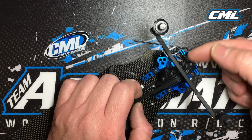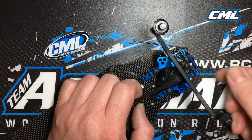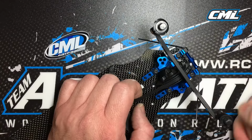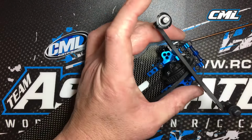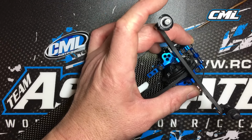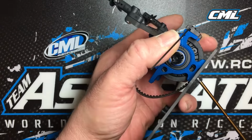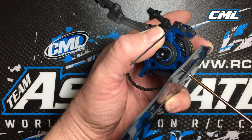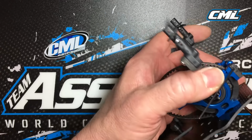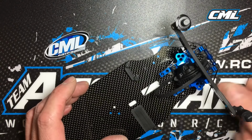And you might think that, oh, that needs filing down a bit because there needs a bit of play, but the chances are it's just your bulkheads are not aligned properly. So what we're going to do first of all is just loosen everything off. So I'm going to loosen the plastic mounts off there, and I'm going to loosen off the bottom screws of the bulkhead. There we go. Right, so that's all now nice and free and wobbling around.